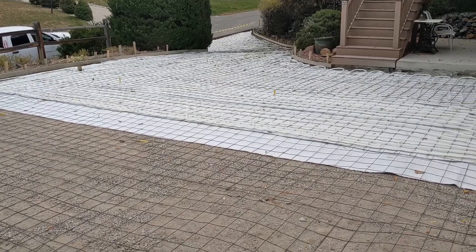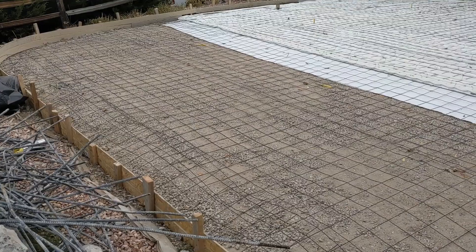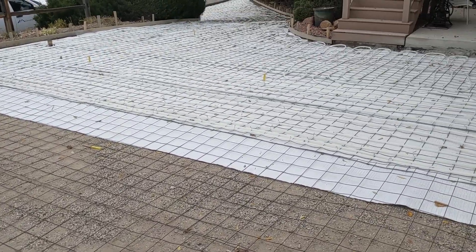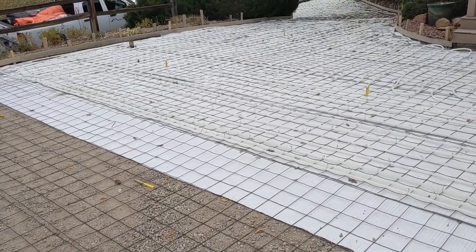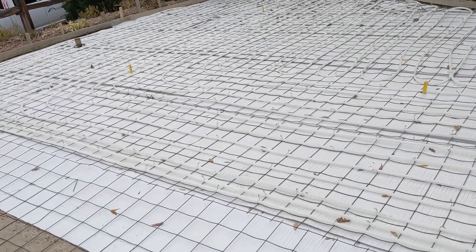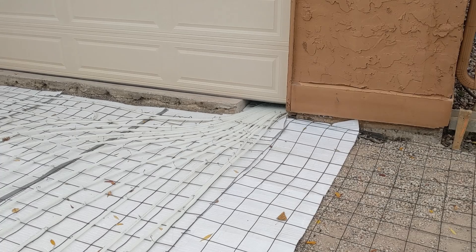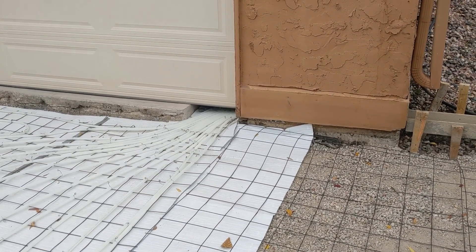So here we see the full driveway. We've got a nice little curbing here and the wire mesh. You'll notice there's an area that the client is not heating. We do have the insulated barrier overlapping into that section just to allow for a little radiant heat to push over. Those white lines you see on the wire mesh are the three-quarter inch PEX line. That runs into the garage with a garage floor cut that we do and that moves over to the manifold system.